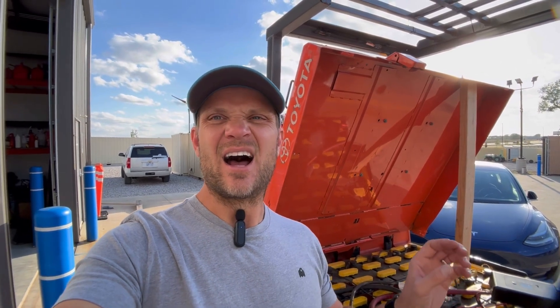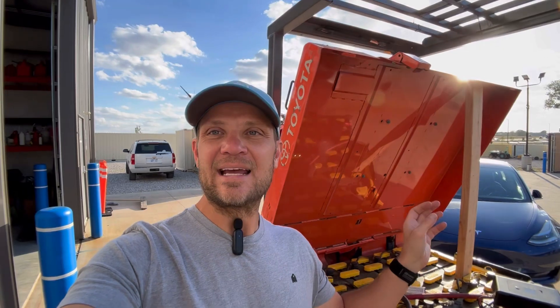What we did next was let that go for about a day. I came back and bumped the NOCO charger — which is a 12/24 volt charger — up to the 24 volt side, and left the other 12 volt chargers on there. Our other option would have been to bring a car battery with the alternator system over, because that's just going to jam voltage in, but I wasn't in a hurry. Once we got the NOCO to charge at 24 volts, I let that sit for another night. Then I've got this little cheapy Amazon 36/48 volt charger — once the NOCO charged overnight at the 24 volt setting, the cheapy 36 volt charger then picked up charging.